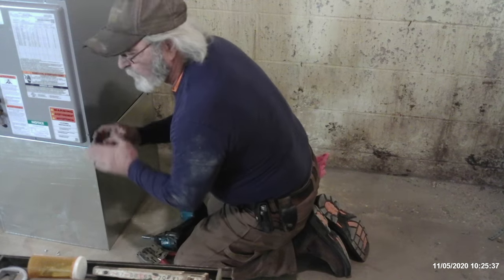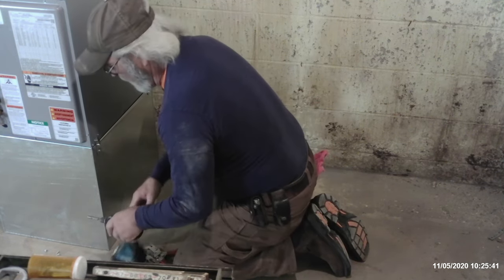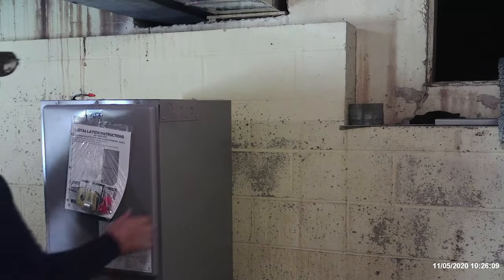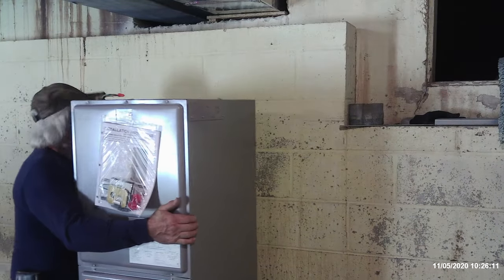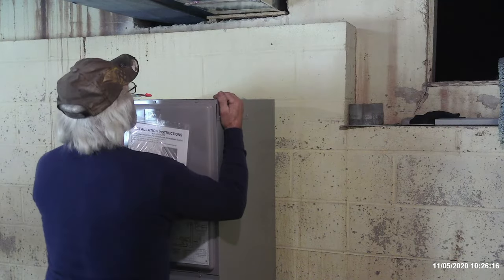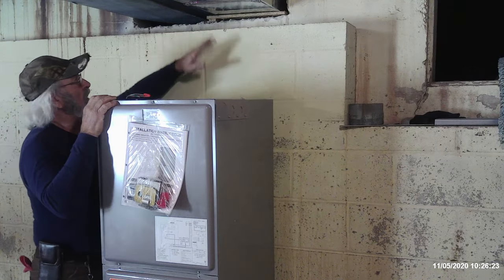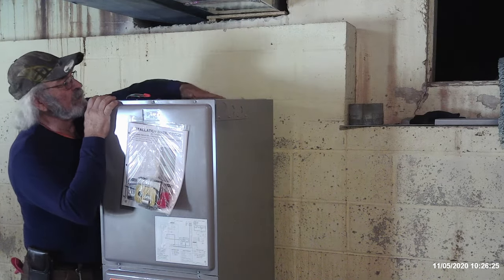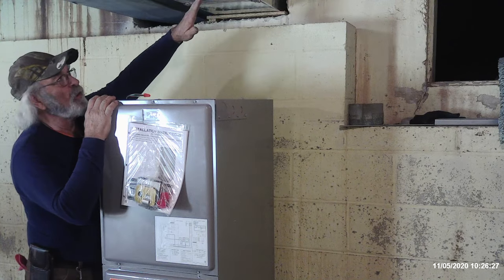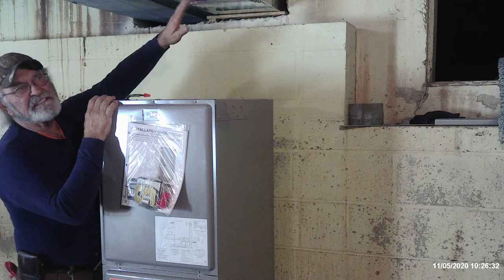The second screw keeps those from shifting like this. Keeps everything nice and square and plumb. Now we're going to set it under the trunk line in the approximate location it needs to rest. And we'll get our measurements, transfer our measurements from here up to there in order to make the opening in the duct to connect that plenum adaption with S's and drives.